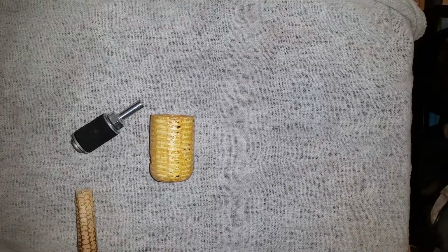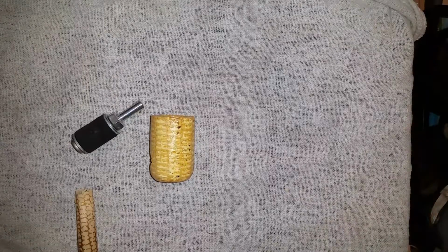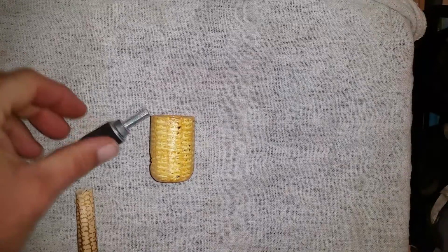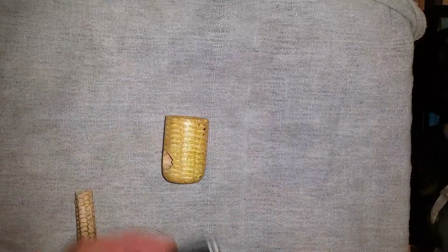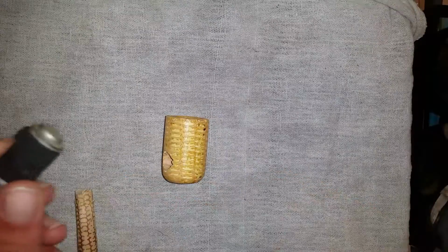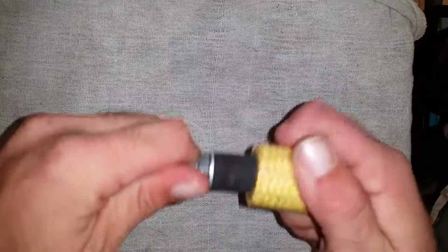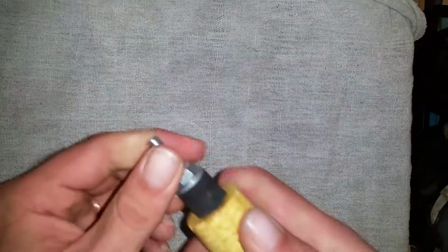So, moving on, we're going to talk about actually spinning this thing on the drill press. Yes, you're going to need a drill press again. And you need one of these little barrel sanders. I believe this is a 1/2 inch if I remember correctly. What we're going to do is loosen it up. We're going to take the bowl and you're going to shove it in there.